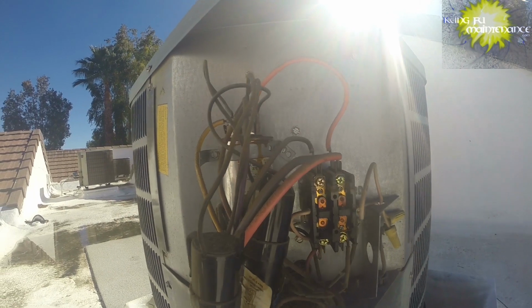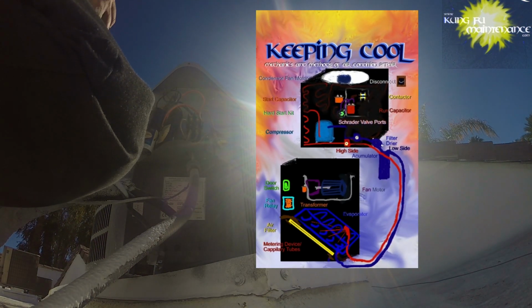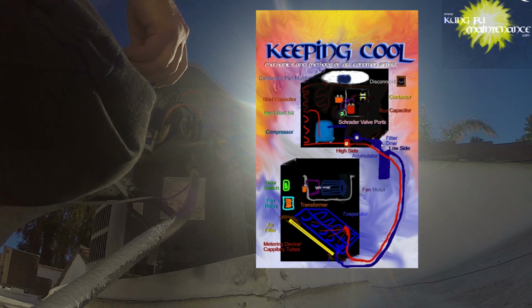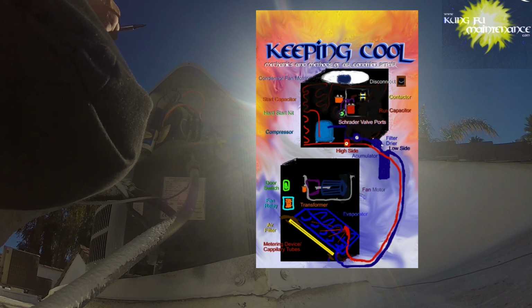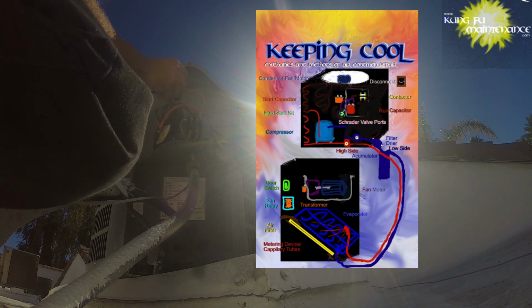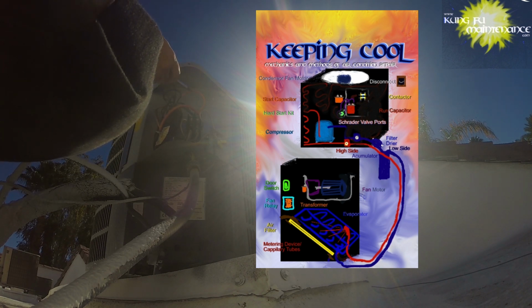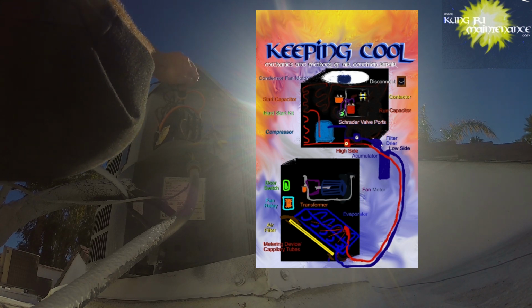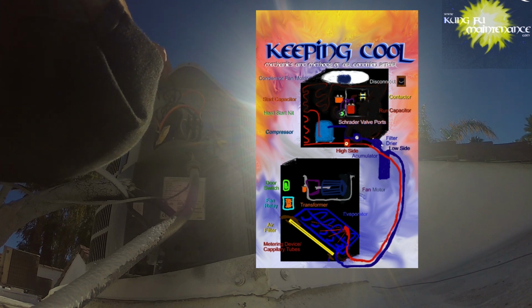So my guess is our capacitor's gone out. And 30/5, I don't think that's right. I think it should be a 35. And this one really doesn't look like the original capacitor. I think I'm gonna go with the 35. And I'm gonna be changing this one out anyway. So I'm gonna pull this.